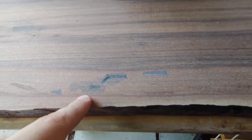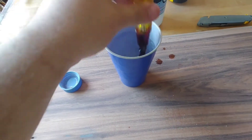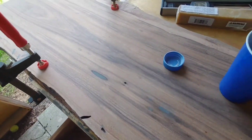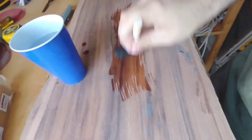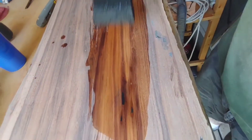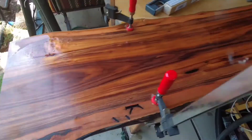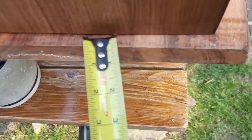I think I'm going to go up to 400 on this project, not quite decided yet. Normally I shellac the project before I fill any holes with epoxy. I'm going to end up using this oxalic acid to try to get rid of the bleed from the dye. I just mixed some oxalic acid with water, and only in these two holes did I not pre-shellac everything. If you shellac it, there's no bleed through on any of the dye. I had a little extra epoxy left over when I first bought the slab, so I filled a couple of holes right away and it ends up being the bottom side.